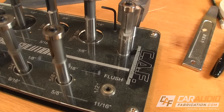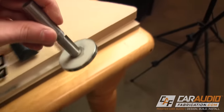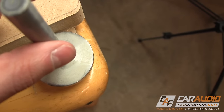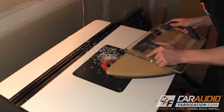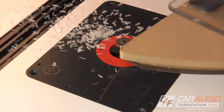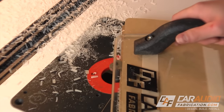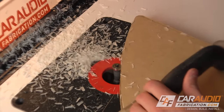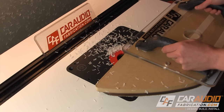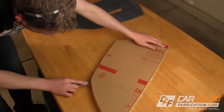Now if you plan on cutting thick acrylic or aluminum, this is a must-own router bit kit. As you can see, each flush trim bit has a different size bearing. This allows you to step down through the sizes and cut the material in a small amount on each pass. I've loaded in the largest bearing and bit first. When I make a pass, only a few locations around the shape will actually get cut. Next, I step down to the next bearing size and make another pass. I repeat this process several times — it is time consuming, but it keeps things safe as you're only removing a small amount of material at a time. It also helps save the life of your bits and gives you a better edge cut quality. For the final pass, I cut the acrylic flush with the edge of the wooden template. As a final touch, I like to add a small 45-degree chamfer to the edge to give it more of a finished feel, giving me my completely shaped piece of acrylic.